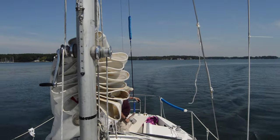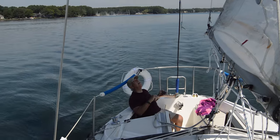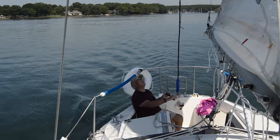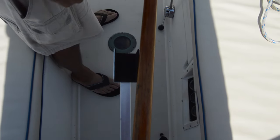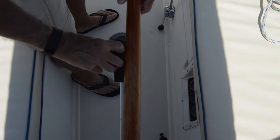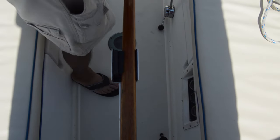To change course or in an emergency, lift up on the tiller to take control of the boat or completely take tiller tender out of the receiver and store. As the boat will change course slightly as people move about, use the 1/2-inch neoprene shims on either side of the tiller to adjust the course.